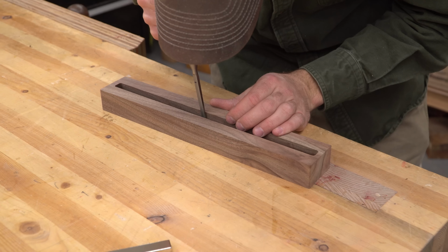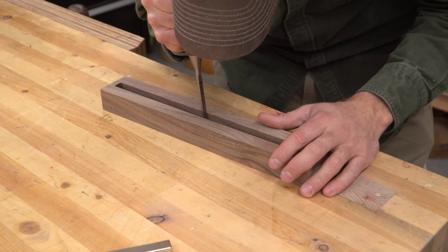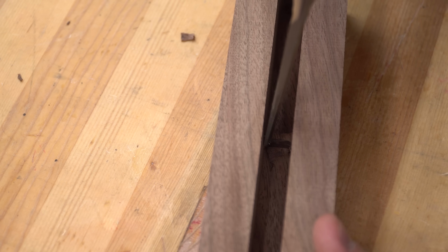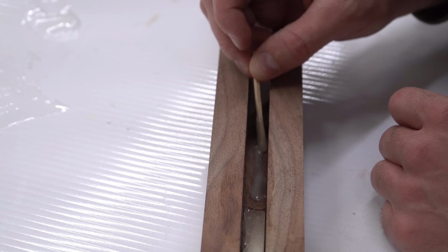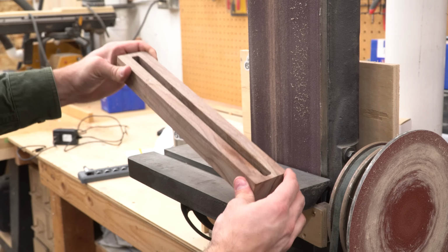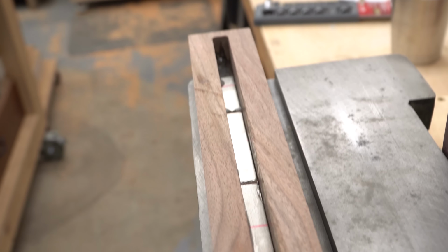I used a 1/4-inch bit in the X-Carve to remove the material faster, but this left the magnet pockets with rounded corners, so I quickly used a chisel to square them up so that my bar magnets would fit snugly in place. I put a little bit of epoxy in each of the 4 pockets, then pushed in the magnets using a dowel. Then I set the whole thing face down on a metal surface, which let the magnets act as their own clamps while the epoxy set up.